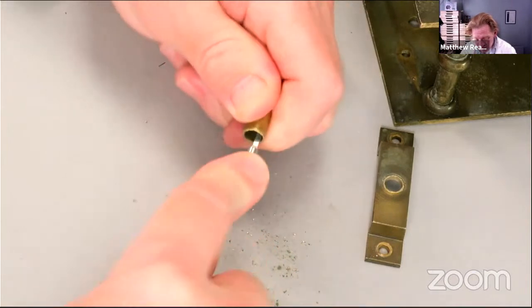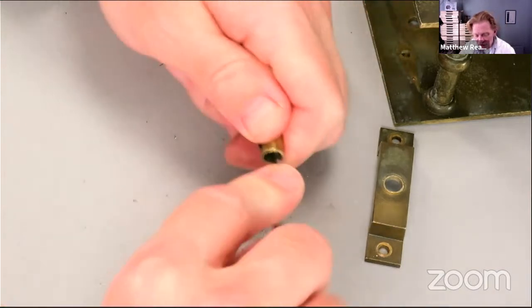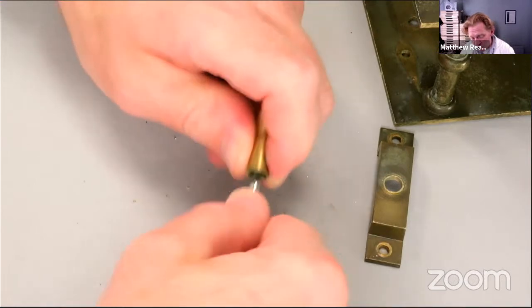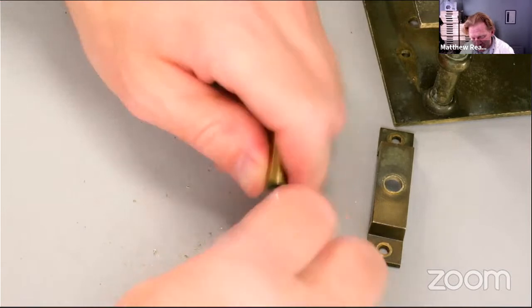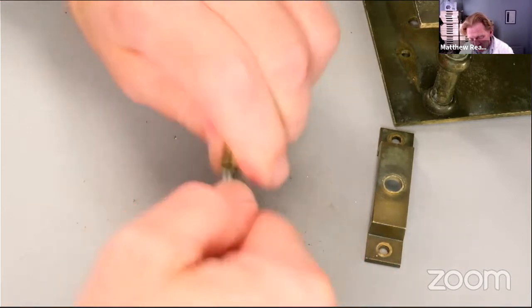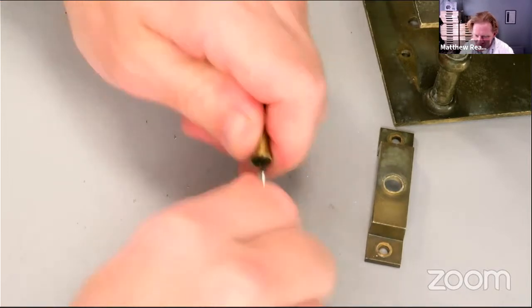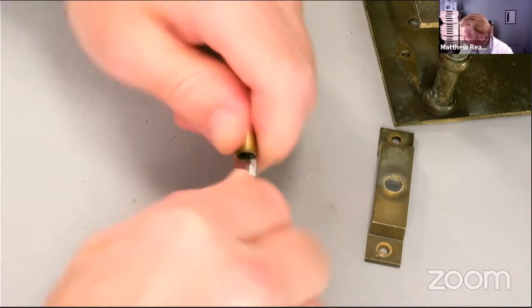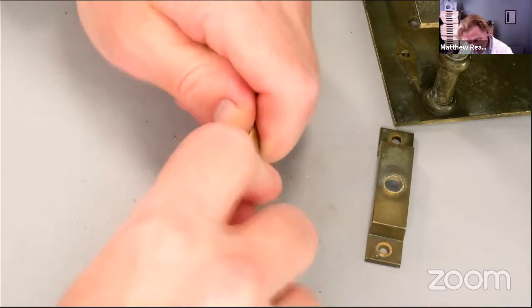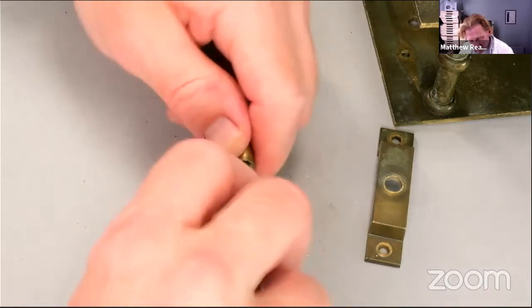I don't know whether it's parallel or not. No, it's not, it's tapered. So presumably it was drilled or from a casting and then broached. And when you start broaching these bigger holes, it's quite tricky to keep them completely round. So the texture inside there is quite organic. But definitely, you could use Scotch-Brite or coarser steel wool, which I have across there, would help. Maybe I need to get off my seat and actually go and get some.